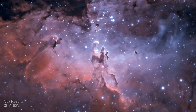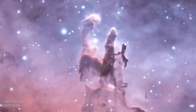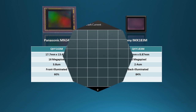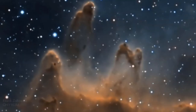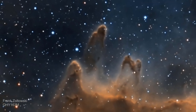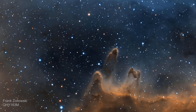The remaining specifications are more alike than different, but for completeness we'll mention the primary specs of dark current, read noise, full well capacity, dynamic range, and frame rates. Dark current is the accumulation of electrons generated in the sensor itself rather than from conversion of photons, and is also a source of noise in a long exposure. Fortunately, dark current and its associated noise can be reduced dramatically by cooling the sensor. The Sony sensor is well known for its low dark current and has about half the dark current of the Panasonic sensor, but both are very low. When cooled to about minus 15°C, both sensors have dark current of less than one one-hundredth of an electron — extremely low, facilitating long exposures without significant dark current noise contribution.